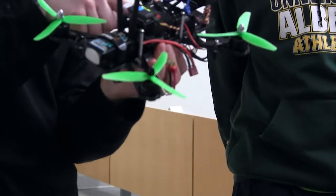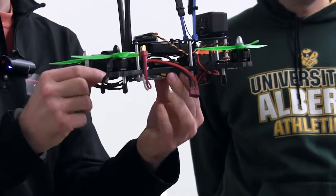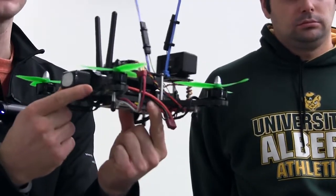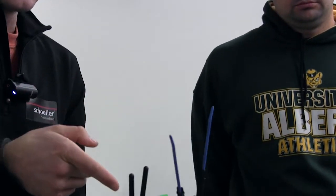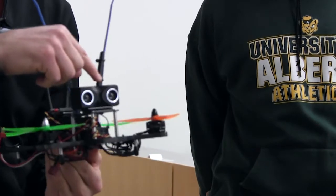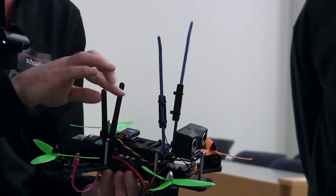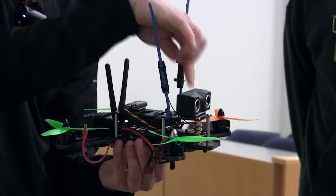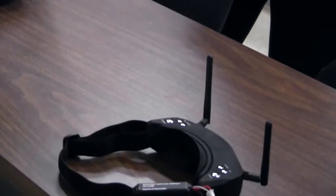There's another chip on here called the 6050. It's got the gyroscopes and accelerometers that tell it what's down and what direction it's moving in, so it has real-time feedback in flight. Some students who came early got to have a first-person view through the two cameras. This is a stereoscopic camera and stereoscopic transmitter — two antennas for each of the two cameras — and my receiver does the same, so you're seeing the first-person view with stereoscopic vision.